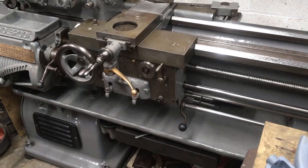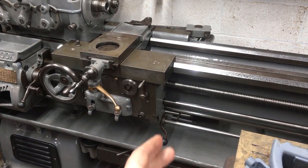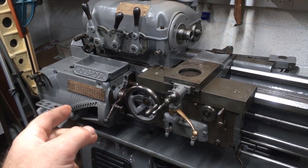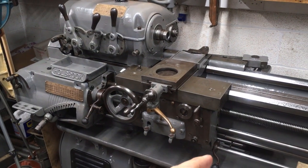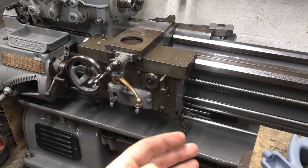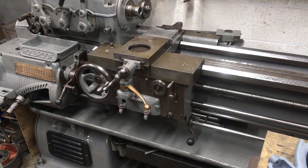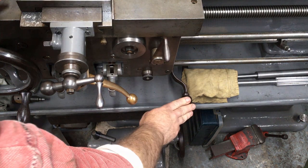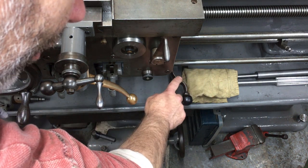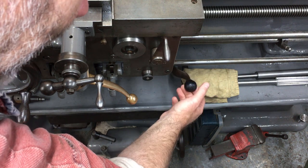It's not an uncommon setup. The dog clutch may be different, but that actuator system moving backwards or forwards on the apron allows you to engage, disengage, and go forwards or reverse. When rebuilding this section, I found I couldn't get the drive to consistently engage or disengage — only in one direction, when the handle was pushed down. After messing about with it, I determined there was a problem inside. This selector lever is used for forward and reverse, but there's slack — a key that sits in this keyway and it should be a much tighter fit than that.